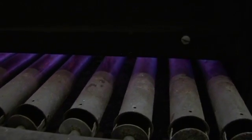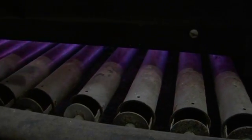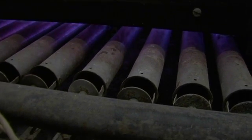Basically, to maintain inside of here, you obviously shut off the boiler, then remove each one of these ribbons, brush them down, vacuum them out, and then vacuum all inside the fire chamber to make sure there's no loose debris on the bottom.